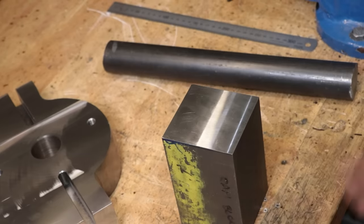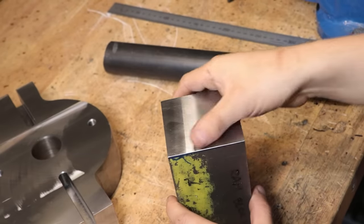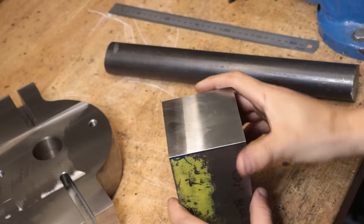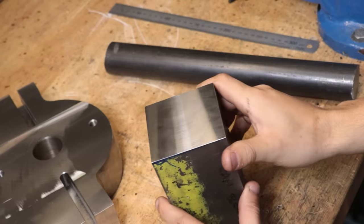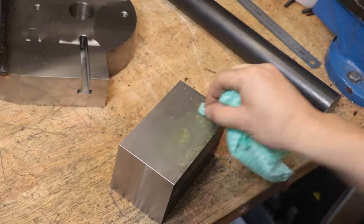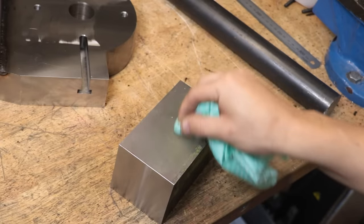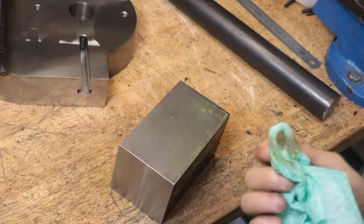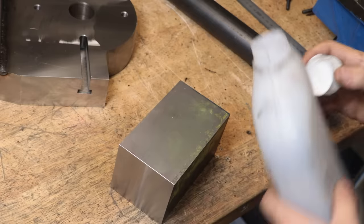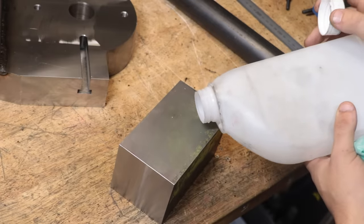The first thing I'll do is machine up the round block. In a press like this you actually use a screw to drive a round block rather than using a screw directly to do all of the pressing. There's probably a few reasons why you might do this. For one, it's just going to be a lot more rigid because once we add the guides for the round block, that's going to stop any deflection.